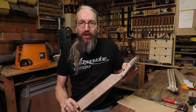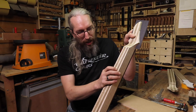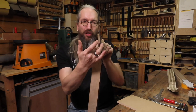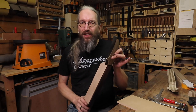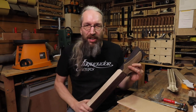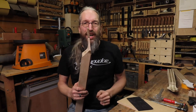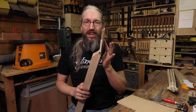And the nice thing about this is that the ebony striping, so the maple ebony and black limba laminate returns, or is also seen now on the headstock. So I hope this looks nice. It fixes my mistake or the accident, and it gives me a nice design feature in return. So if you end up by accident with a headstock that is too thin, just apply a veneer.